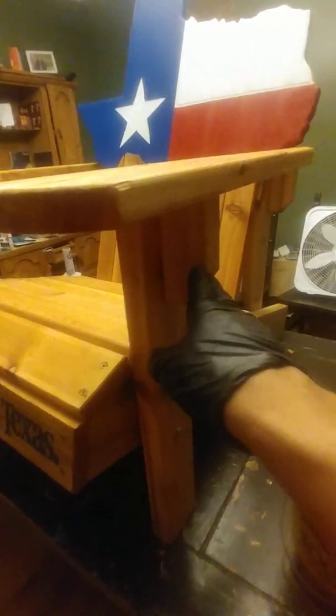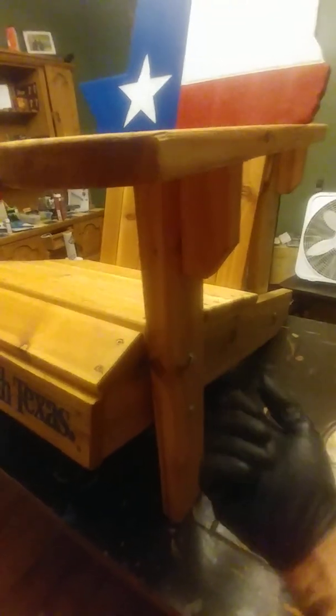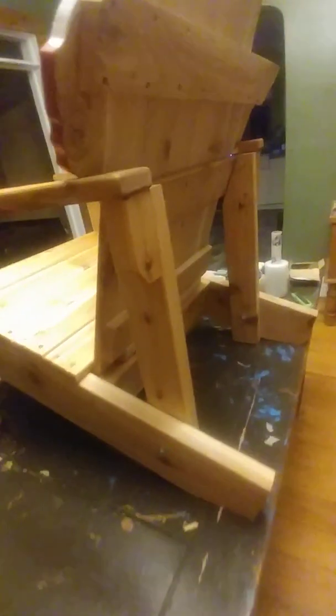The second and third things that you're going to put on are your legs. Your front legs are going to have the outside support. Again, look for the labels, right and left, inside, on the front. The back legs are going to be a little bit different because the 2x4 is going to have an angle. So there's your right, and there's your left. In between the back legs is going to be the back support. This here is going to be a 21-inch board. The rest of these seat slats are 24 inches, so they're 2 feet. It's the only one that's smaller. These fit right in between.